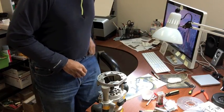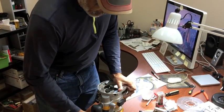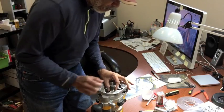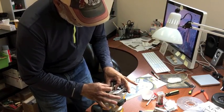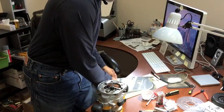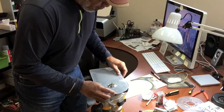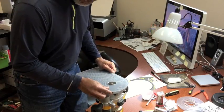is take this guide pin and insert it inside of the collet like so. So you put this in here and I'm just gonna hand crank it down, hand tighten it. Don't really need to be real tight right now. And then once it's in there, with the beveled sides of the holes up, you push this down here like so, and you simply spin it until you see the holes in your base lined up with all these pre-drilled holes that they have on here.